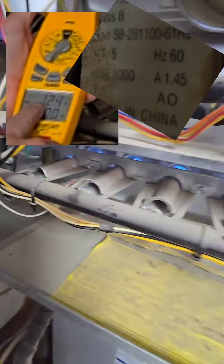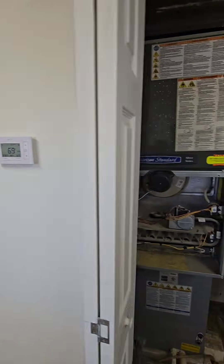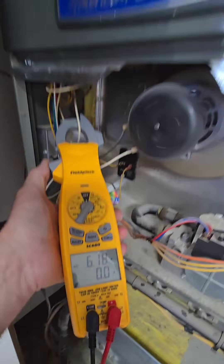We're going to make sure that all the burners are firing up all the way across. The general color is acceptable. Note the bad location of the thermostat. And then as the system cycles off, I'm going to check the amps of just the blower motor by itself.